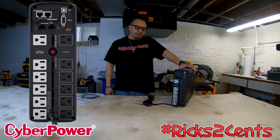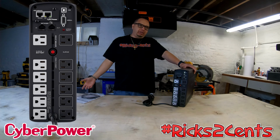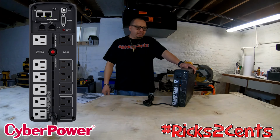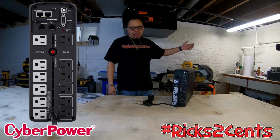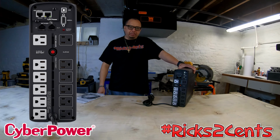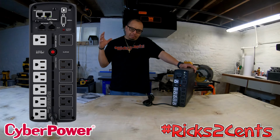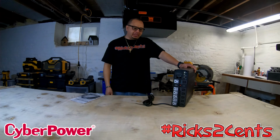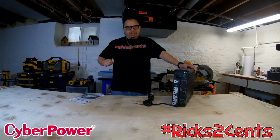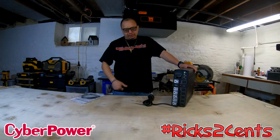That's another question I've been getting a lot: when you're setting up your shop, how many amps do you think you're going to need for your shop? Is 40 amps enough? And when you start running big pieces of equipment like chop saws and table saws, sometimes you'll start flipping your breaker all the time. But if you have some of these, and some equipment has a big amp draw, that'll help on it besides protecting it. So it might be something you want to be interested in if you don't have a lot of space in your panel, or don't have a lot of dedicated power to your wood shop, and you're flipping a lot of breakers. You may want to just get one of these.